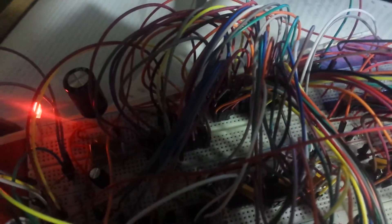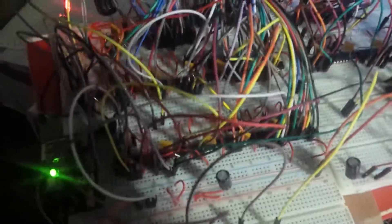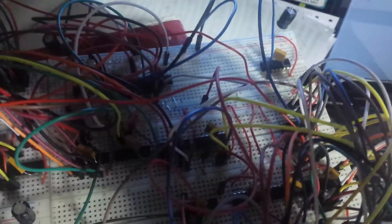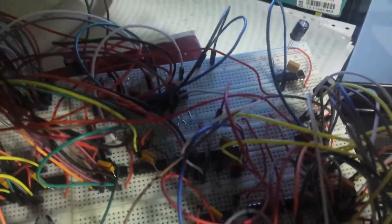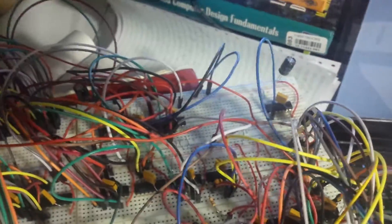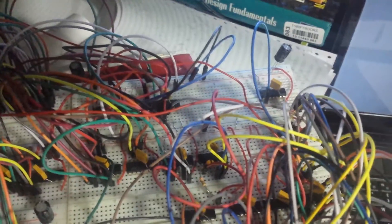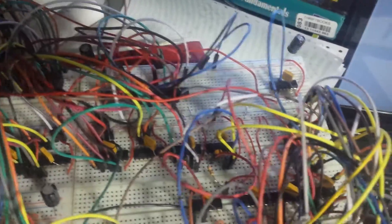There's an 8 megahertz crystal oscillator, there are a couple of counters, and there's some logic to generate the horizontal and vertical sync. On the right side there's some logic to generate when the shift register will load bytes from the ROM.